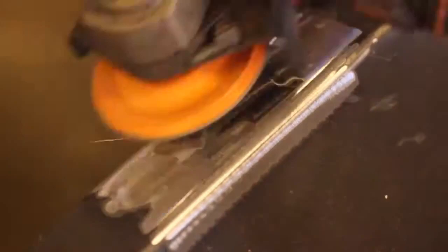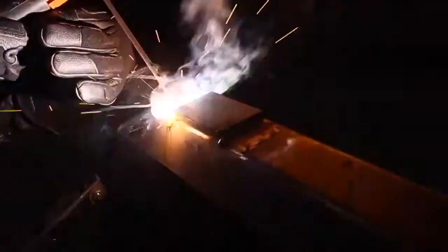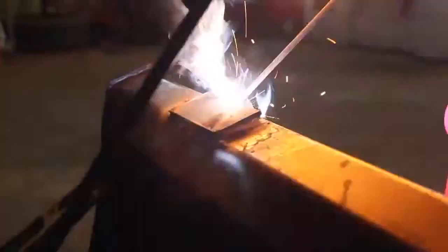In many cases like what we're doing here, it's a really good idea to mount a plate between the surface of the material and something that's going to be pulling really hard on it — like these hooks, or perhaps a D-ring for example. That way the hook pulls on a piece of thick 3/8" plate we're adding, which works to more evenly distribute force against the bucket itself, making it actually easier for the bucket to withstand a greater amount of force.